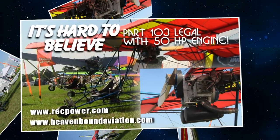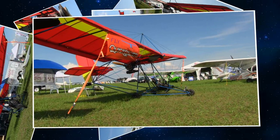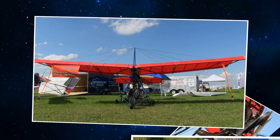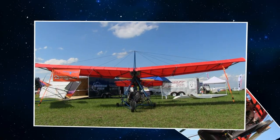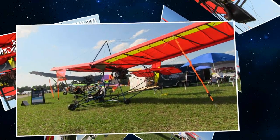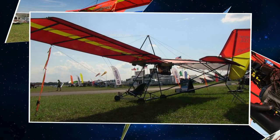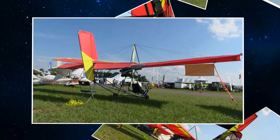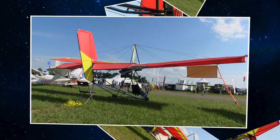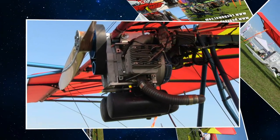Matt, you've done a lot with the F33, which is 28 horsepower — that makes this airplane fly okay but nothing like 50 horsepower. If you're at high altitude, going with floats, or you're a typical American weighing 250-plus pounds, this extra power will come in handy. Does this also run smoother than the F33 being an opposed — sometimes called a 'boxer' — engine? Oh yeah. The pistons fire opposing each other, so they absorb their own internal inertia. It's smoother than an inline.